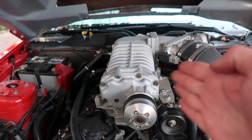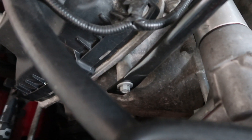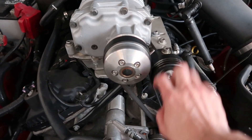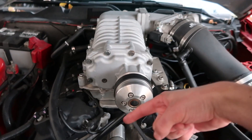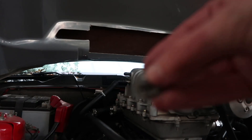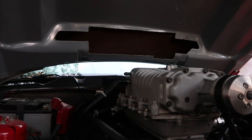So look here — we kind of made a little gap because there's a little ridge right here and the tensioner was pressed up against it, so it was cocked at an angle. You can see there was a mark of where the bolt used to be, and now there's actually a gap because the bolt has scooted away — the belt is stronger than the tensioner and it's pulling it right, causing the bar to scoot right. So I'm going to loosen these two bolts, push it back, re-tighten, and I've added a lock washer to hopefully keep the bar from moving.